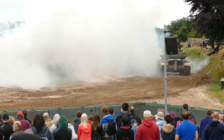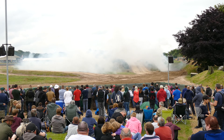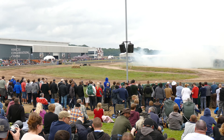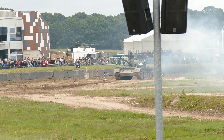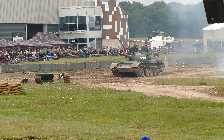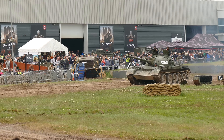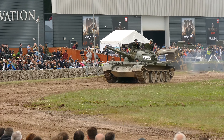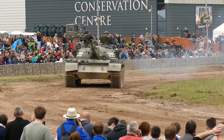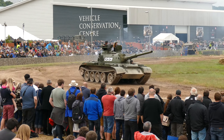The smoke it's generating, as I mentioned earlier, is diesel put onto the hot exhaust pipe — that's exactly what the T-72 was doing earlier on today, and our T-72 uses the same system. The idea of creating a smoke screen is that you can back into it quickly and reposition yourself without being seen by the enemy. That's another reason why tanks have smoke dischargers — those little pods on the sides of the turret — to fire out a pattern of smoke grenades. A nice big smoke screen builds up and you can disappear and reposition yourself behind it.